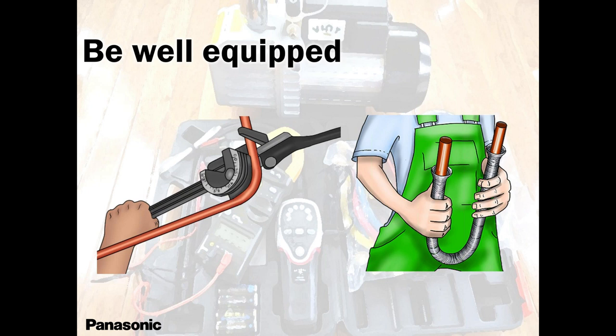Even if you have a slight kink, avoid it before you take off. Get rid of that kink, please, because it's going to affect the efficiency. The compressor will work too hard. It's like a blockage in your system. Your heart is going to overwork. So please, kinks are not acceptable.